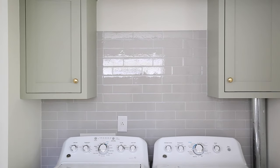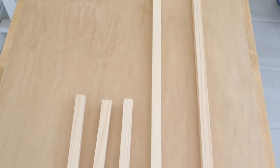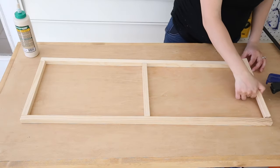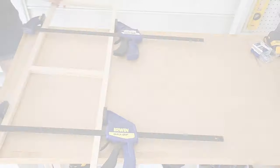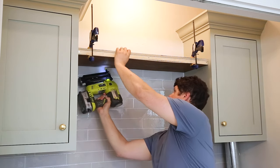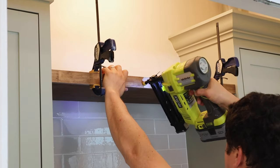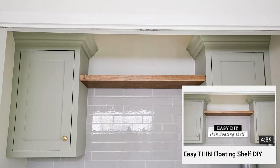The next step for our makeover is to build and install a floating shelf between our two DIY cabinets. I wanted it to be a more thin floating shelf rather than chunky for a more modern look and also to save space with our hanging rod. To make the shelf thinner, I'm using three-quarter inch square dowels for the shelf frame support, quarter inch plywood on the bottom of the frame, and half inch thick plywood on the top for the shelf. I assembled the frame together with just screws and wood glue. Then Brandon attached it to our wall studs and cabinets and trimmed it out. Because we were able to secure the shelf on three sides, we were able to make it deeper — just over 13 inches deep. I recently shared the tutorial video on how to build the shelf if you want to see more details.